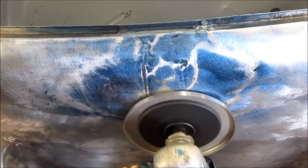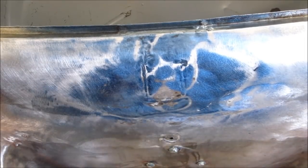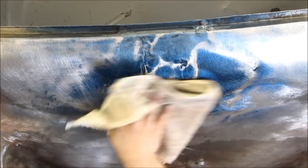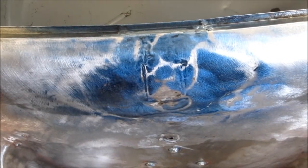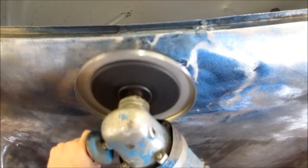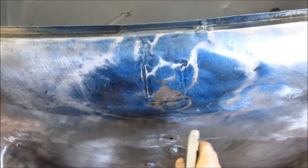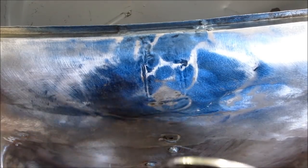My left hand is my dominant hand, and it works the best for me. But everybody's different, so make sure you try both hands if you're new to this, because one hand may work better than the other. And make sure you use a flat hand, not your fingertips, or else you won't be able to properly feel the panel and the damage. You're trying to feel the variations from the different surfaces and find the extents of the highs and the lows so you know where to work.